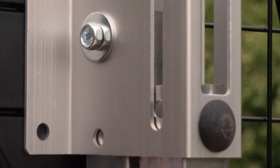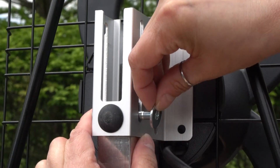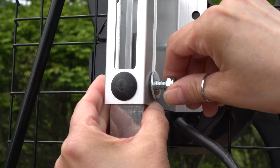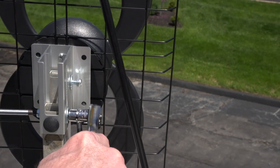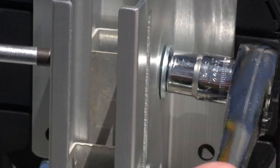Place the washer on the bolt, and then slide it through the mast bracket and elevating mast. Then add a washer to the other side of the 1⅞ bolt, add the nut, and tighten the bolt and nut by using a screwdriver and a 10-millimeter ratchet. The bolts will fit loosely to allow the antenna to lift up and down on the elevating mast.